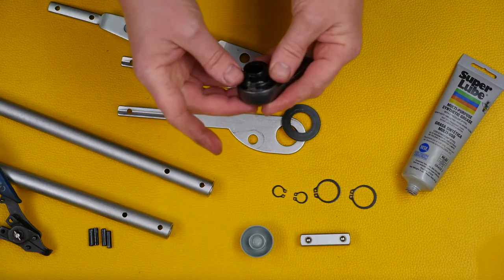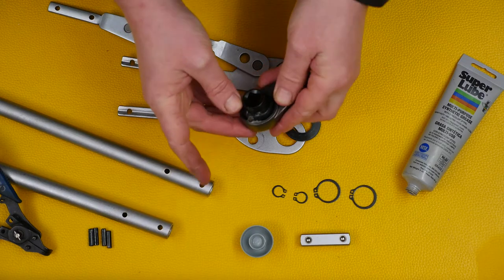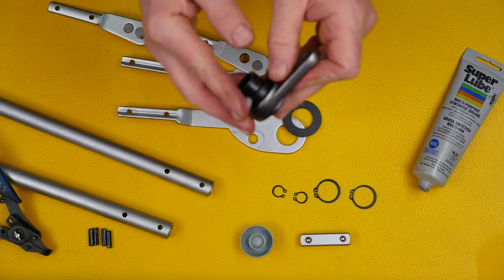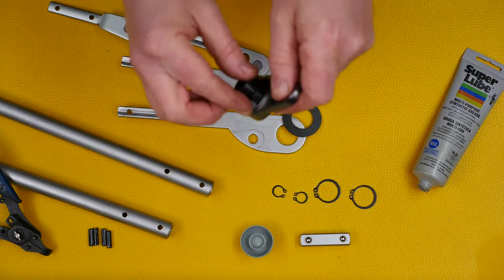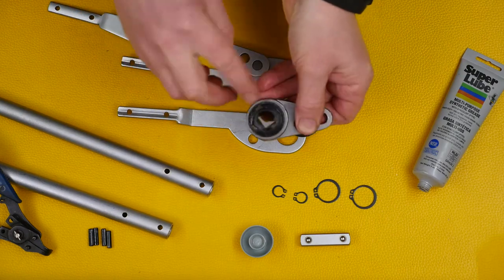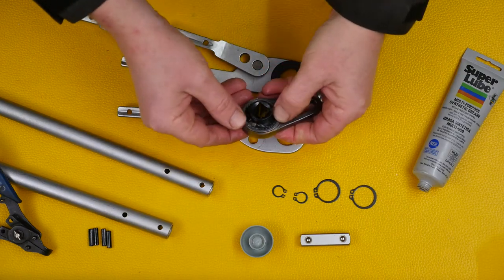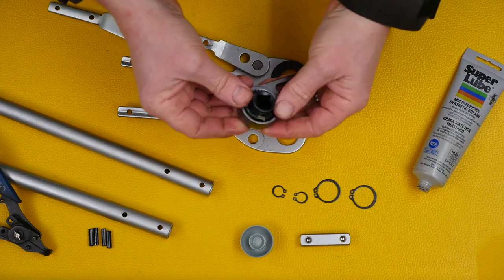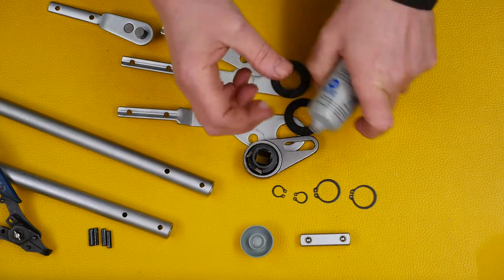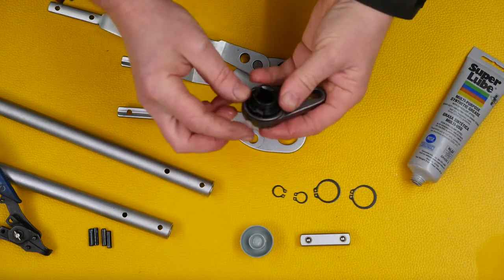I won't actually remove that part from the mechanism because if the little spring shoots off — and there might be a little ball bearing on the end — I'll never find that in the garage. So I'm going to use Super Lube. I understand Snap-on use Super Lube, so if it's good enough for their ratchets it should be good enough for this. You don't actually need too much — this is a case of less is more, because you don't want to pack it, which would prevent the pawls from seating correctly against the ratcheting mechanism. I'm going to carefully pull that outwards to get the grease in towards the middle of the mechanism without actually removing it, then push it down and do the same again on the other side, being very careful that those don't spring off.